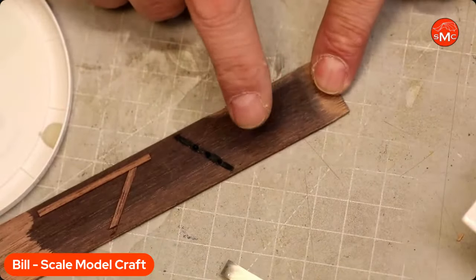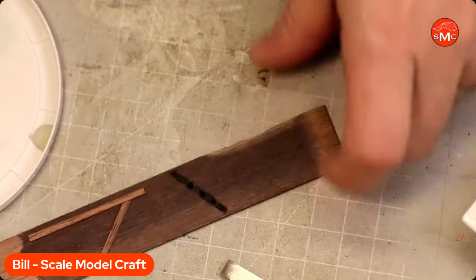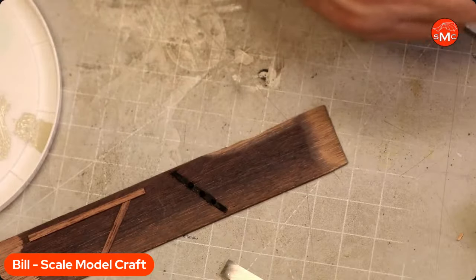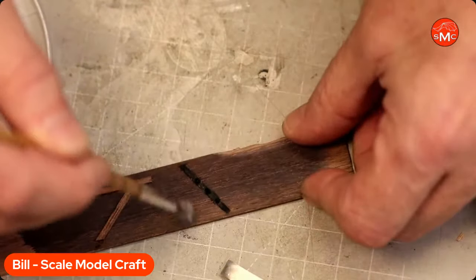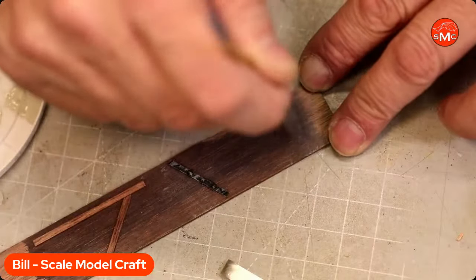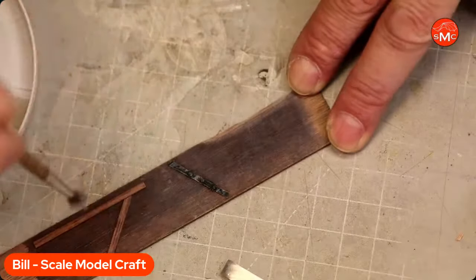So this has been brushed with the ebonizing vinegar, and I said we'd talk about that. Ebonizing vinegar is made by taking 4-0 steel wool, so it's like 4000, you know, 0000, four zeros. That is the fineness of it. So it's the finest steel wool that I can get commercially. You can buy it in a craft store or a hobby store. So I take that steel wool, put it in some vinegar,